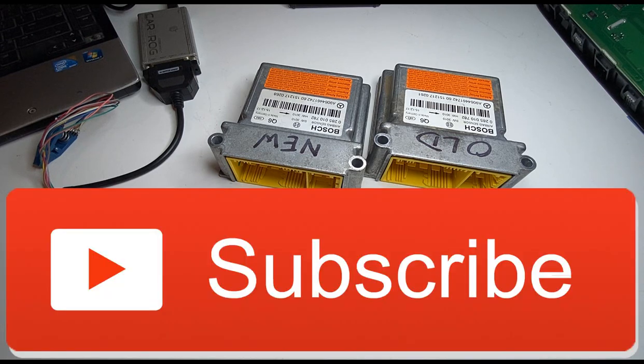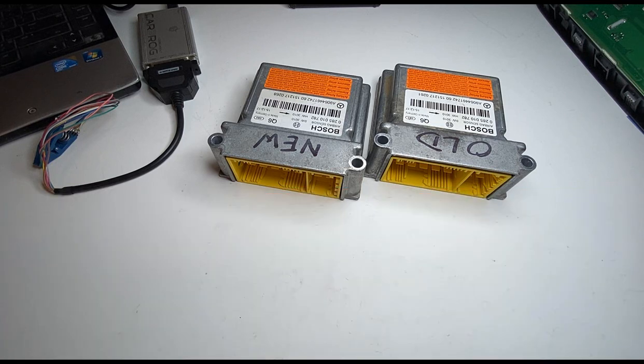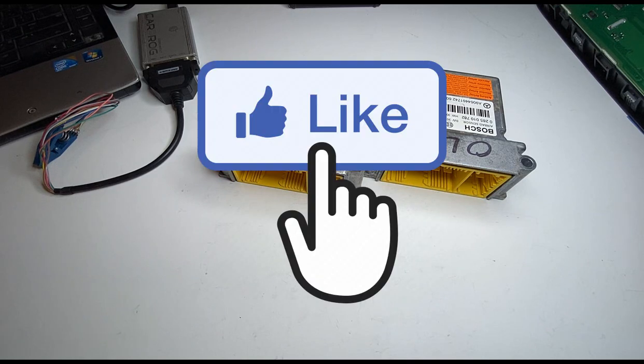It has VIN and coding information in it, and sometimes the dealer may program it or may not. Sometimes they'll want you to get a brand new one because they cannot overwrite the old VIN number or old information in the donor airbag control module. So, a simple video on how to do a clone. This is an easy one. This one has an EEPROM.